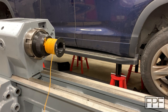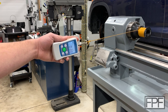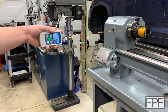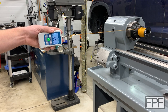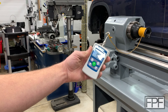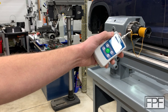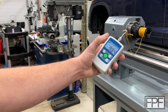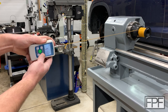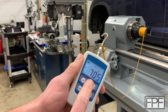My string might actually be too long — this is going to be really hard to get all in frame. Let me back the camera up a bit. I can set this on peak and we'll see how much force it takes just to get it moving. So, quite a bit — 9.84 pounds to get this guy moving. Again, these bearings are not warmed up, I might need to slacken these off a bit, but let's see if I can get a measurement of what it takes to keep it moving. I think I'm naturally pausing as I'm zeroing it, because I don't believe we're really at seven pounds to keep that moving — although it's possible, these bearings are cold. I think what I might have to do is a split screen so you guys can see the spindle turning as well as the display on this.